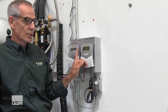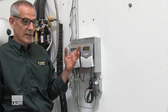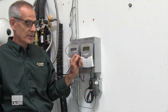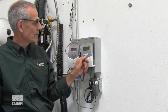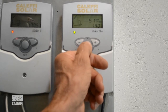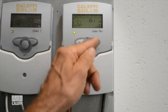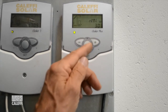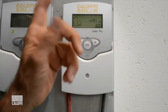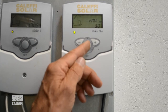The last one is the storage temperature. The menu is going to explain what it's asking. I look at that as storage max — the maximum temperature the storage tank will go up to, in this case 140°F, which is the factory default. We're going to accept that. Then we've got the arrangement, the storage, the pump speed, and the minimum pump speed. If you're going to use the variable speed function, this is how low the pump can rev down to — it comes factory set at 30%. We're going to accept that.